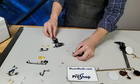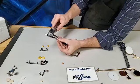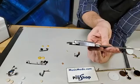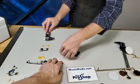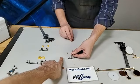And then let's see what this guy is right there. It may be very similar. Yeah, let's see here. This one again, just that cardboard back. Oh, cool. Okay. Just the cardboard. This is coming out to an 8.40, so it's just a little bit bigger. Now if we're going just by our measurements, the 8.4 would be closer in size to this 8.8 ID of your pad cup. So my guess is that this slightly larger pad is going to fit in the pad cup.